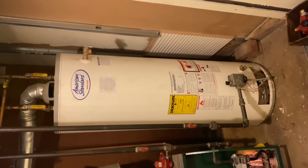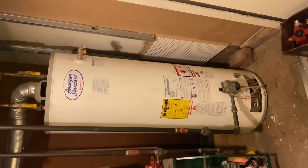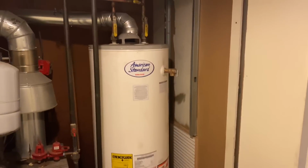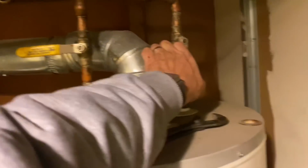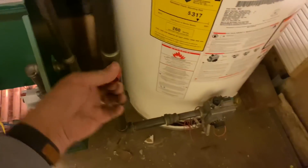Now, let me show you how to drain the water heater. You lay it down on its side and let it drain naturally. Nope, I'm wrong. All right, first things first. We're gonna isolate the water heater completely. Boom, boom, boom. Let me turn our gas off as well.